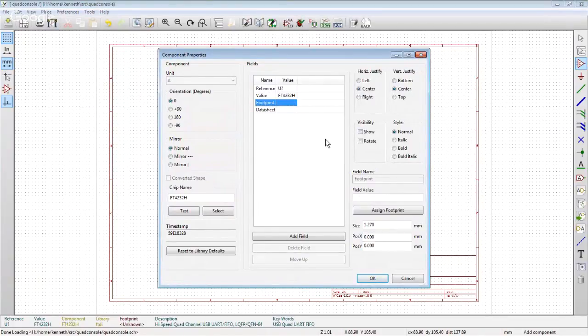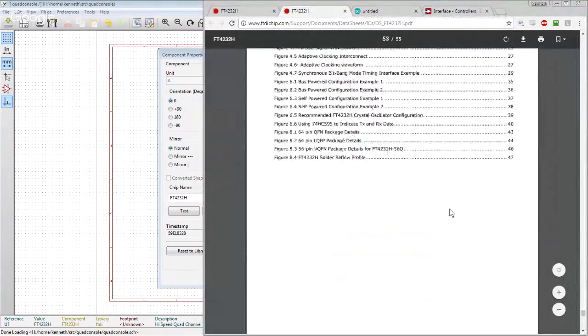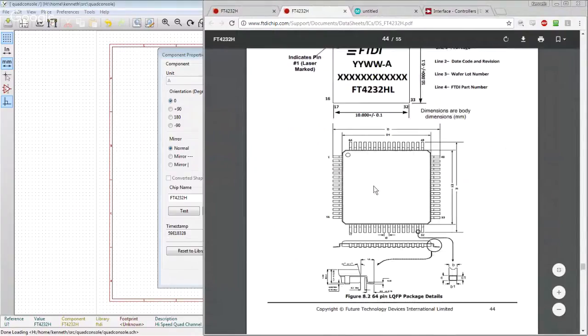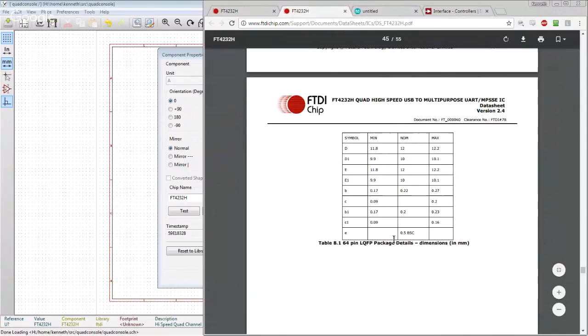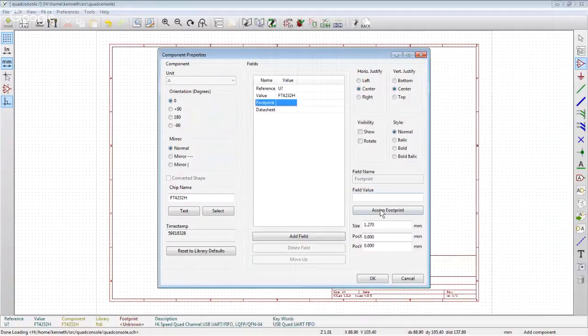I mean, if we're really lucky, because what, we're gonna need a QFP something. All right, so we're LQFP 64, and the main thing is I always like to check the pitch, which is a lowercase e here. So we got a pitch, half millimeter. That hurts.